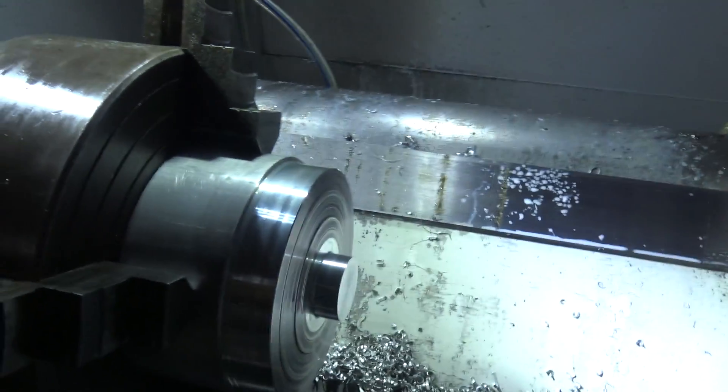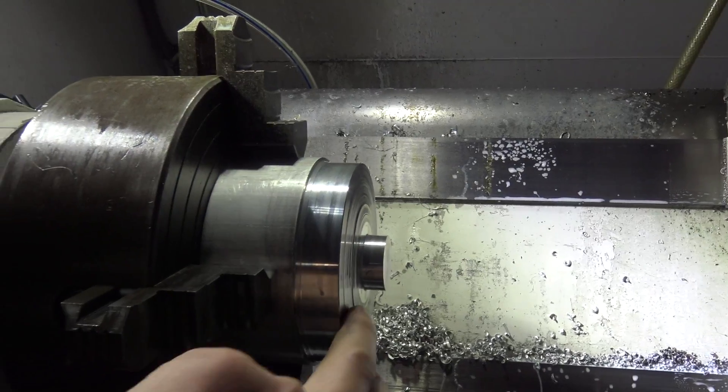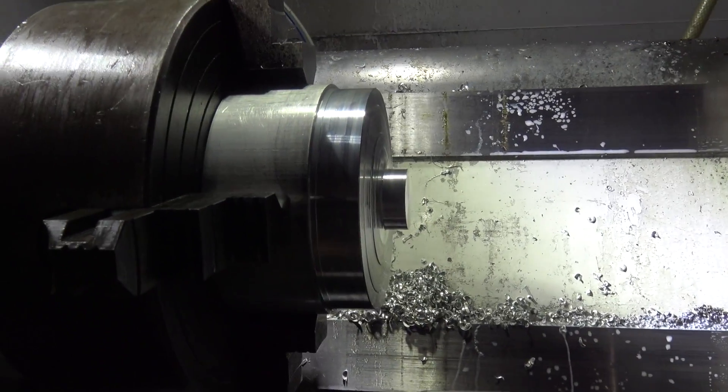Remember how I was just saying we've only got one piece of raw material for this? I should have stopped it when that chip breaker wasn't working and just reposted. Because look — this has never happened to me — the chips actually created enough of a displacement that the machine lost steps and created a tapered finish there. That's totally no good.